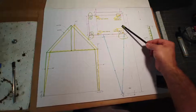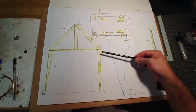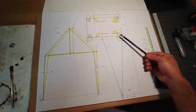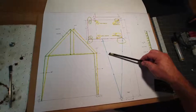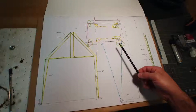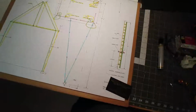would sheathe the inside walls, which is going to be how I intend to preserve the condition that we put it into. We can get it back, but I highly recommend adding structural integrity by way of sheathing the inside of this entire end wall. And before we do that, we could pull a little bit if we need to get it perfect, ultra perfect, or even hyperextended a touch if we feel that it's pretty springy and may relax to perfect. So we have that available to us.